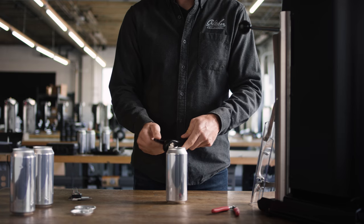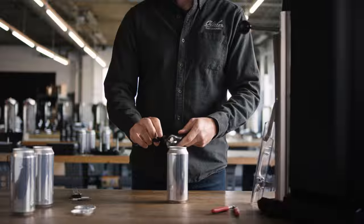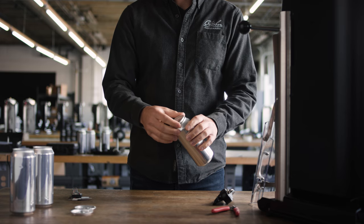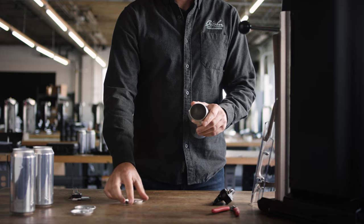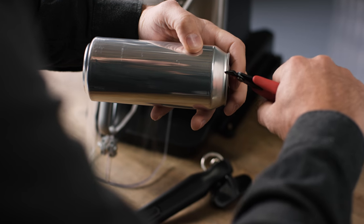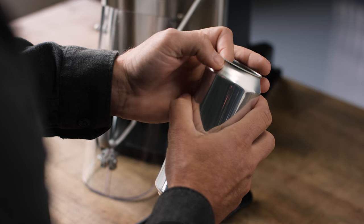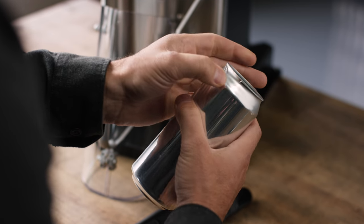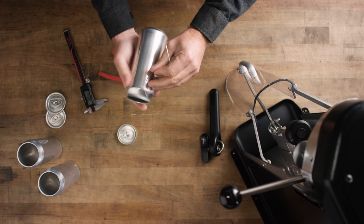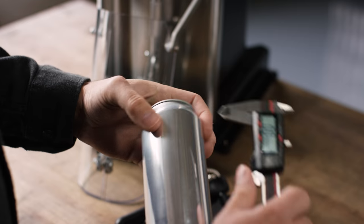Using the teardown tool, cut off the top of the can. Using nippers, cut a notch through the seam. Next, pull the seam out of the can body. Then measure the leg of the seam on the can in at least three places.